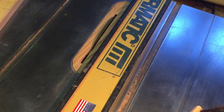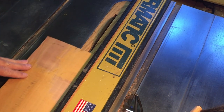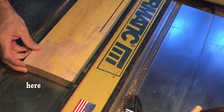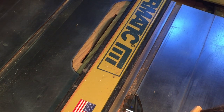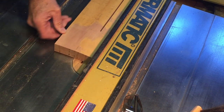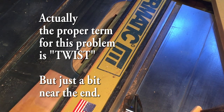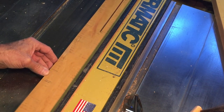I want you to notice that I had my safety glasses on there, but it was pretty cold in the shop and my safety glasses started fogging up on me. That was a situation where wearing those particular safety glasses would not have been too safe because I couldn't see as clearly. I'm going to show you some of the mistakes in here — if you look closely, you'll see that the back side of that board actually rises, and if I pushed down on it, it would pinch the blade. But I am aware of it.